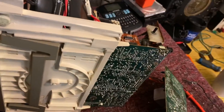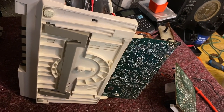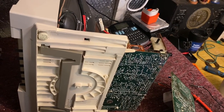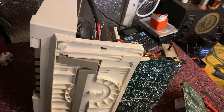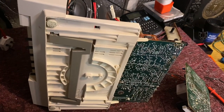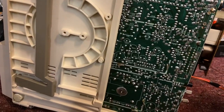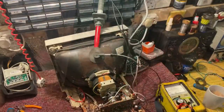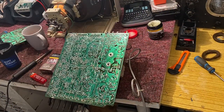What I'll do is have a break from this, relax for a while, then come back and have a look at the main board - see if there are any cracked or cold solder joints, clean the plug and socket connectors, and see what's going on. Hopefully it might just burst into life. I will inspect the board just in case there are any broken traces.